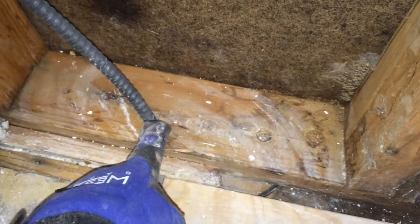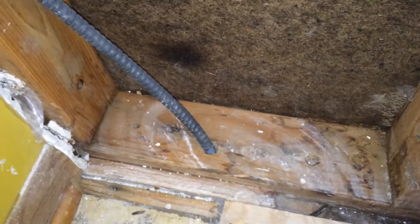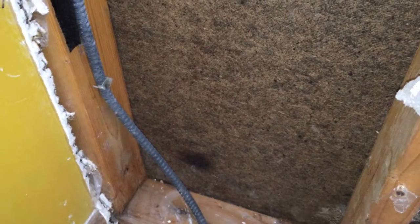It's not that much work. And then any penetrations coming through, like this electric line right here, needs to get hit as well. You can do this work with either a caulk or a foam, whatever you're comfortable with. The foam is probably faster.